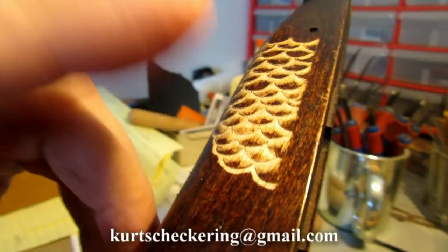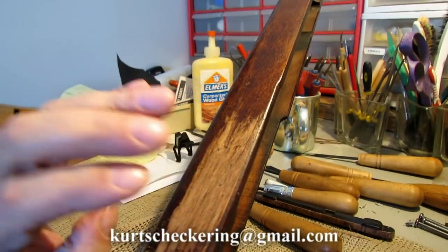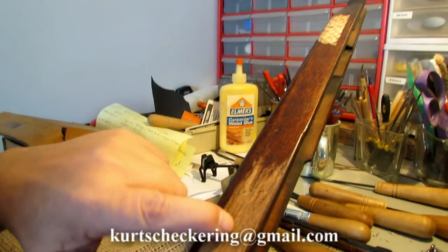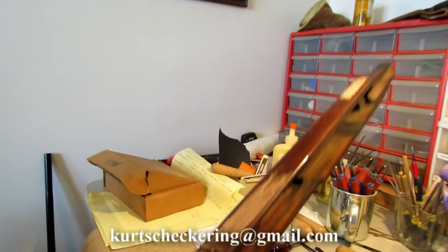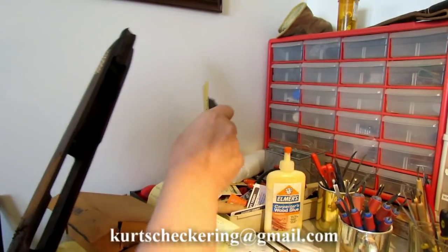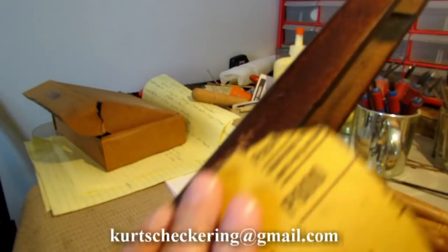The natural color of raw wood is pretty white, and this area is a little darker because there's still a little bit of staining — the oil goes a little deeper, it's kind of feathered in. Once you've got the whole thing stripped, then go over it with sandpaper, probably 200 to 320 grit, depending on how many scratches and dings you've got. If there are quite a few deep scratches, use a more aggressive paper. Always go with the grain.